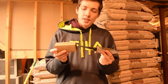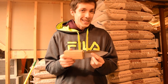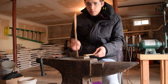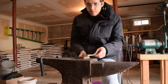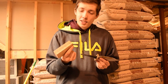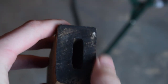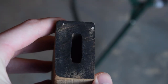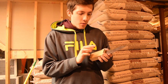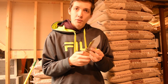Our block of wood is now fitting flush with the bolster and I smell like a forest fire — guess you could say I'm a hickory smoked Todd. But this time it's not for nothing; we do have a 100% intact handle piece with no splitting along the grain like there was in the last piece of wood we tried. Now it's time to drill the holes in the handle material and the tang and just get ready for heat treat.